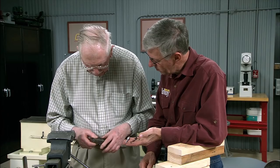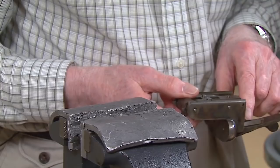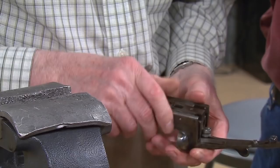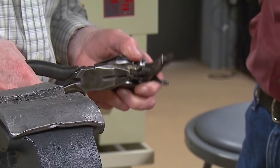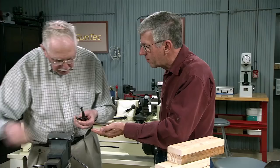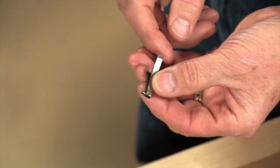The next move is you can either take out your lever spring and take your lever work out, or take out the inside work. I think we'll take the lever work out. What you can do — you just need a pair of pliers to remove that. You don't need a mainspring vice for that. No, just squeeze it up, pull it out. Chuck it in your box. That's the mainspring — it's got a little bit of a leg on it here. That is the top lever spring — that's a Greener lever spring because this is Greener lever work.